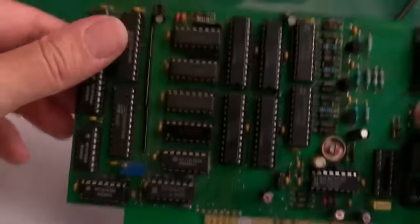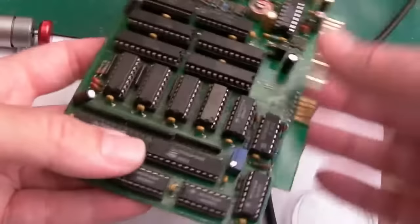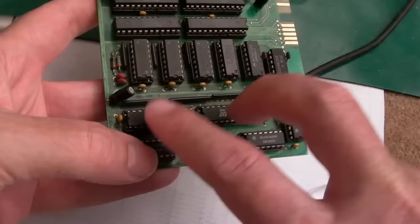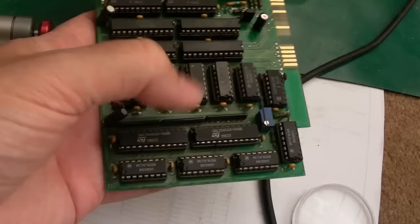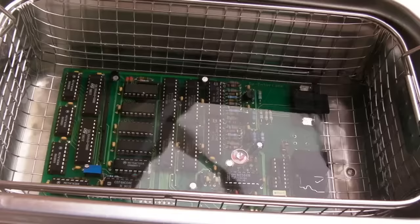I can't see the RAM causing the current problems — it's more likely to be a chip. I've ordered the 74ACT175. The PLL is ruled out. At that point we may need to start scoping the control signals to see if things like direction, output enable, clear, or reset are being controlled properly by the logic chips. Let's just switch that on — no heat.